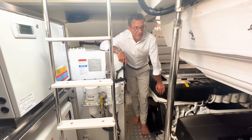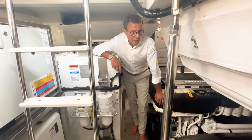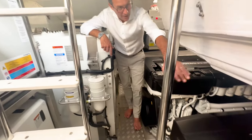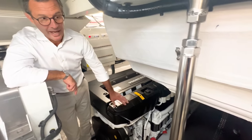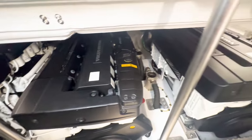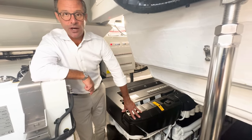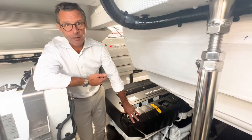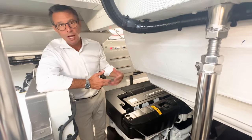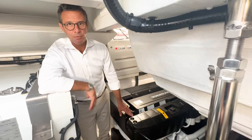So this is another area which has been designed extremely efficiently because it does incorporate a lot of systems and a lot of features, starting of course from the triple Volvo IPS 1050. These are of course diesel engines, 800 horsepower each, which equal 1050 horsepower of a traditional shaft line. That's why Volvo called them IPS 1050, despite the engines being 800 horsepower. And that creates a lot of benefits, which goes from fuel consumption. Clearly, you can produce more equivalent power with a less displacement engine, therefore you're burning less fuel and producing less emissions,